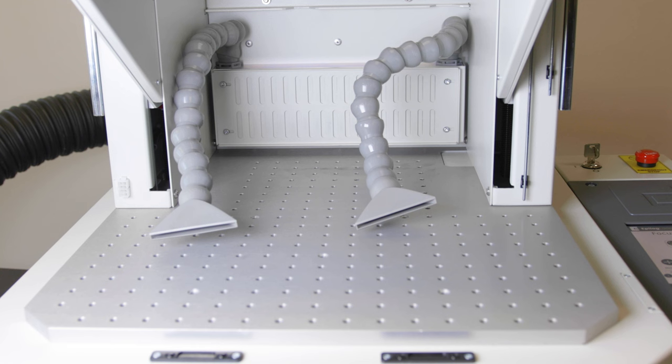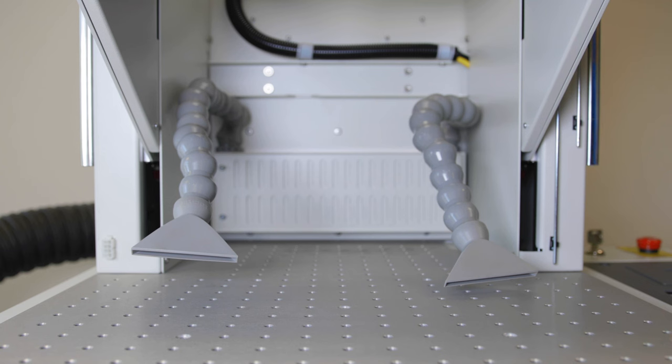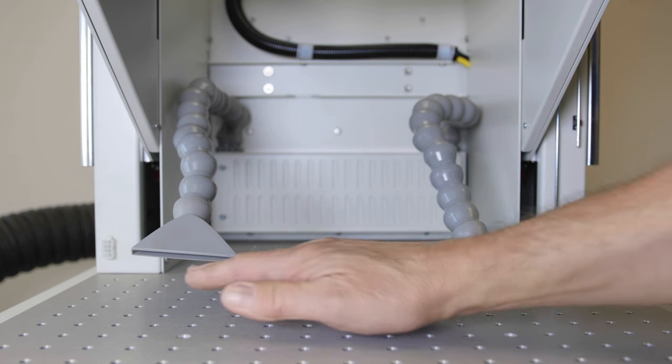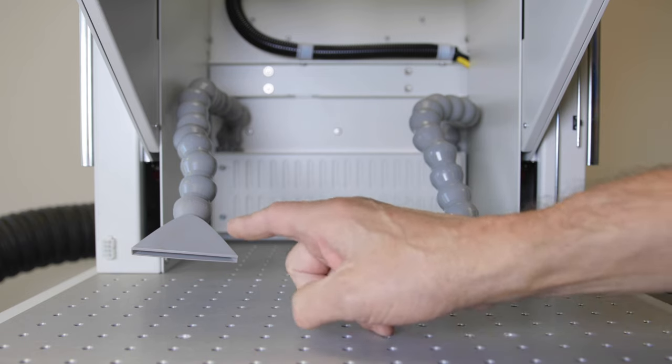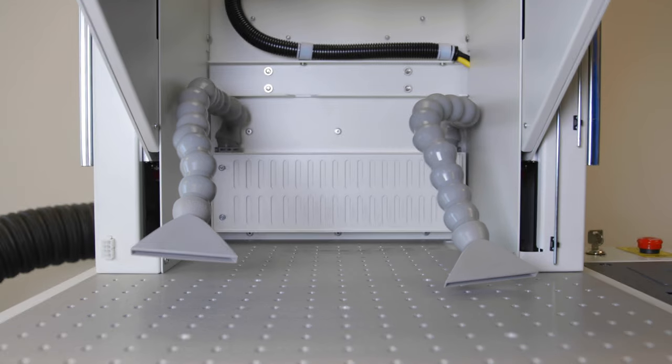The table has an inverted T shape — we tried to maximize the amount of space available to accommodate larger parts. We have threaded holes on 25-millimeter centers to allow customers to create fixturing throughout the back and front of the machine. Our rotary device will sit in this location, and you can see an electrical connection for the rotary over to the left. The rotary can also be installed at the back of the machine to have parts extending out towards the front.